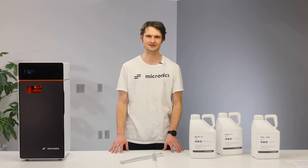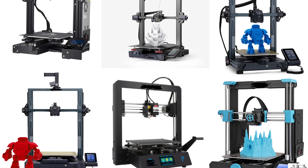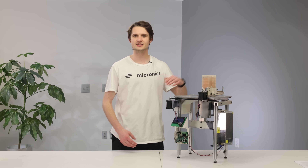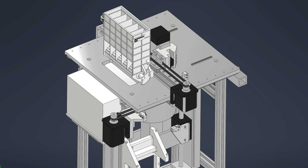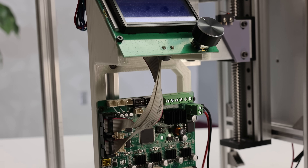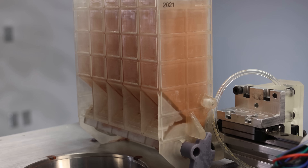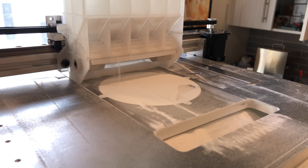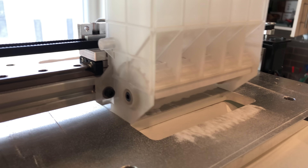Which brings us to our very first prototype. This prototype is the Ender 3 of SLS printers, and it is probably what a bed-slinger company would come up with when they steal our design. We do have patents pending, so dear established companies, please use your own brains instead of stealing ideas from college kids. This machine consists of a simple 100mm cylindrical piston for the build area, a powder dispenser mounted on a movable gantry, and a laser system moving along the gantry. It's all controlled by a 3D printer control board running Grbl. The build piston is driven by a ball screw actuator, and the build surface is mounted on a swivel joint for leveling. The powder dispenser is a resin printed part that has a flap opening at the bottom, actuated by the movement of the gantry automatically, which makes the printer kinematically simple. The powder dispenser and build piston worked reasonably well, but overall this is not a very good design since it is very difficult to use and blasts the laser into the open.